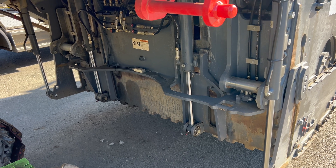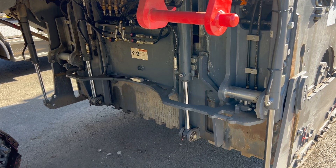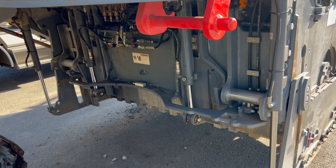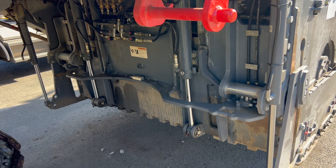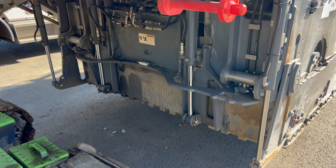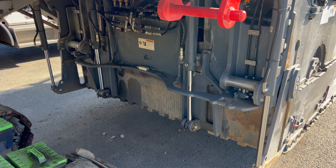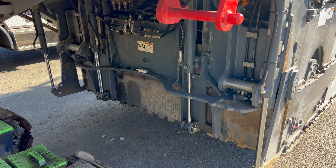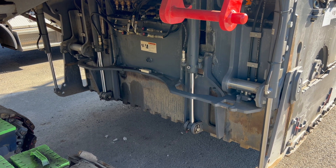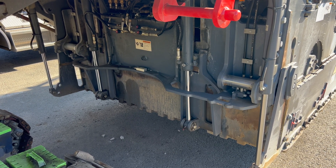So that's how you set the speed of the back door right to left to make it even. It's okay that it moves slow — maybe it takes a little bit longer, but it's going to help you out a lot when it comes to your grading to have that door running as evenly as possible. You always want to adjust whichever side is moving faster. You can try opening up and speeding up the slow side, but usually what you want to do is start with these valves all the way open, then close off the side that's moving the fastest. If one side is moving faster going up, turn that one down. Whichever side is going faster going down, adjust that one down. Whatever side is faster is the one you want to slow down.